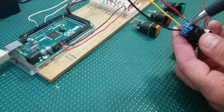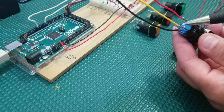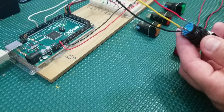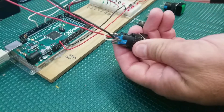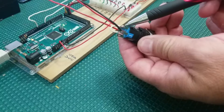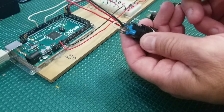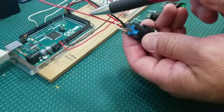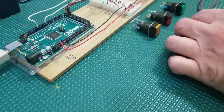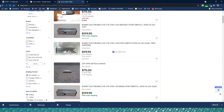If yours doesn't have the letters printed on it, you just need to figure out which contact is normally open and which is normally closed — you can determine that with a multimeter using the continuity function. On this one I also put a jumper between the common for the switch and the ground for the light, then take one ground wire, one wire for the normally open switch contact, and one wire for the light. So I end up with just three wires total going to the Arduino.